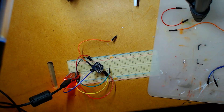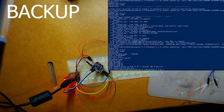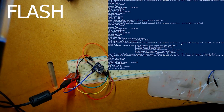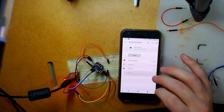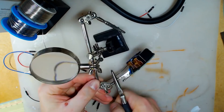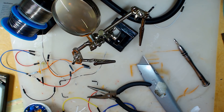I've linked the entire procedure in the article, so please open that in the description in order to find out how to connect the device, how to make a backup, how to erase flash, and how to load the new AFE firmware. Bear in mind, each time you want to do something like this, your GPIO-0 has to be pulled down to ground, and then reset the board using the reset pin. It was time to flash the AFE software. It only took a couple of moments, and I was able to verify that the chip is indeed flashed, because I was able to see the AP point available on my mobile phone. It was time to put everything back together, so I've added the board to the main board again, soldered all the connections, then I took the entire PCB and soldered it with the socket.